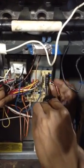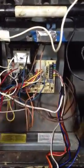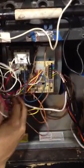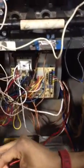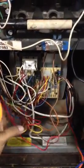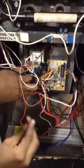Now we're going to hook up the blower motor. We already traced it out earlier: the blue wire goes to high heat, the orange wire goes to low heat, the black wire goes to air conditioning cool, and the white wire is of course the neutral — go ahead and put that on the neutral bar. The red wire goes to park. Then put the orange wire on your low heat terminal, the blue wire on your high heat terminal, and the black wire on your cool terminal.